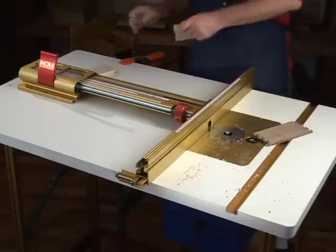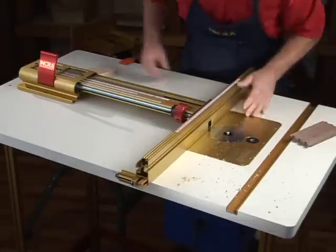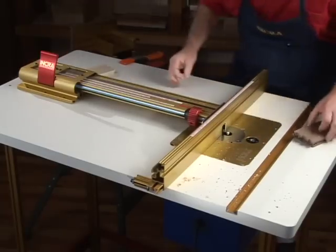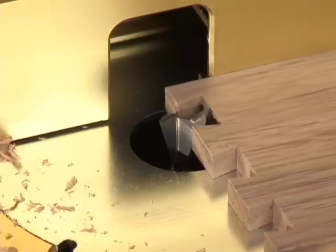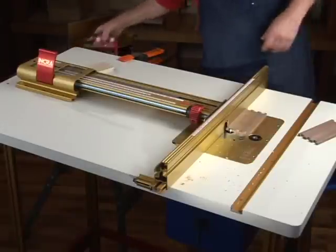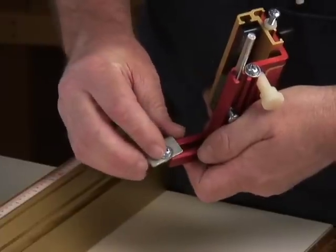We'll now repeat the pin series of cuts, this time with the material face down on the table. Return your LS to the first pin cut on the template. With the router off, slide one of your pin boards to nest the cutter just inside the existing cut. We need to stop the cut just before the cutter contacts the end of the existing cut.